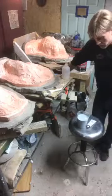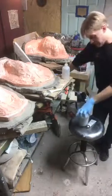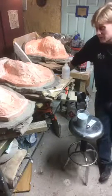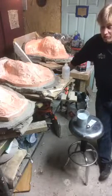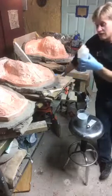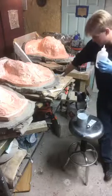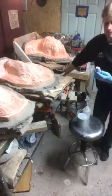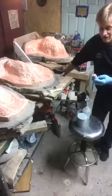But we're going to take and do this. I've got, let's call it 28 ounces worth of Bondo resin, which means I have 14 ounces of Bondo and 14 ounces of resin-ish. This is not an exact measurement kind of problem. This is an approximation kind of problem. You need 10 drops of MEKP for every ounce of the fiberglass resin. And then you need, the precision answer is a squirt. I don't even know exactly how much.